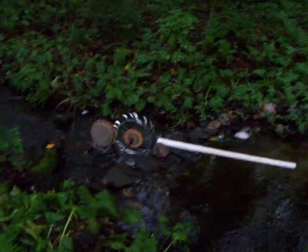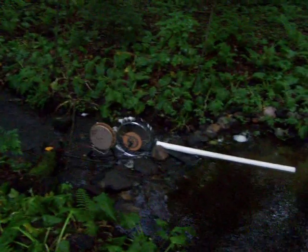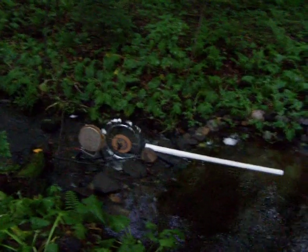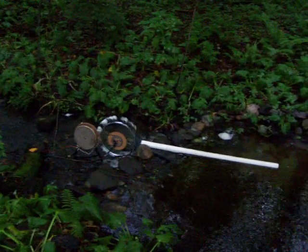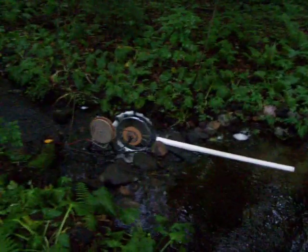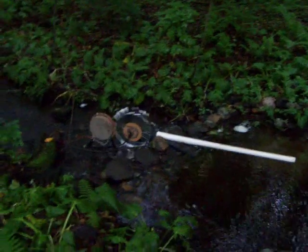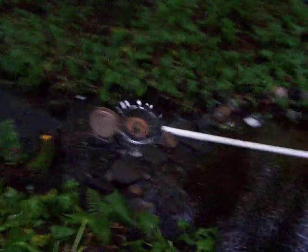I took the wires out of a bunch of old scrap motors I had — all different sizes. The smaller ones I doubled up and ran them in parallel. I made nine coils, about 60 to 65 turns each. I got 24 magnets.